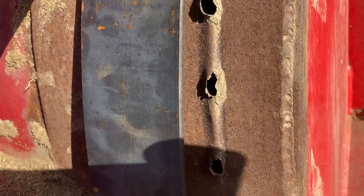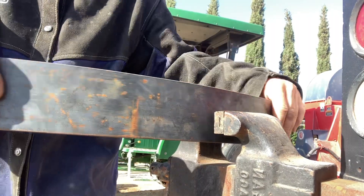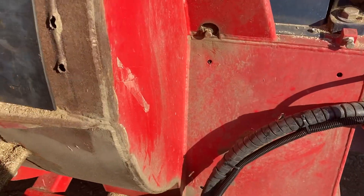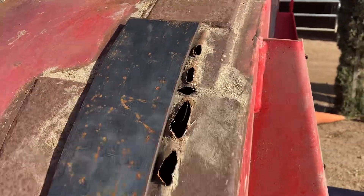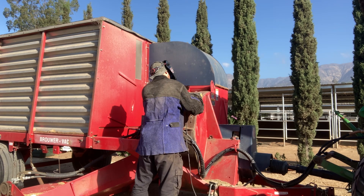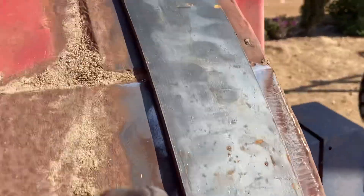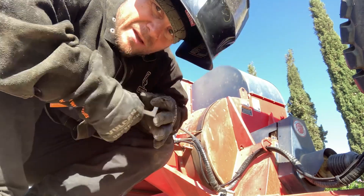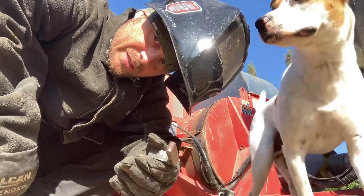We're good on top — I need to bend it right around here, and then a little bit more down, so right around here. Bam, pretty good right there. Now I gotta grind all this out and then patch this on top. It's just going to sit right on top of there and I'm going to weld all the way around this thing. There's nowhere really to connect the ground, so I'm going to take this piece of angle iron, weld it to that bottom piece so I have a place to hook my ground. I'll weld it on one side so when I need to, I can hit it with a hammer and it'll bust itself off.